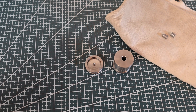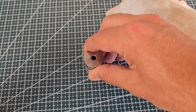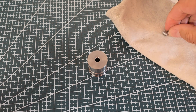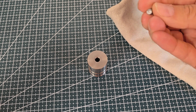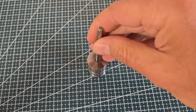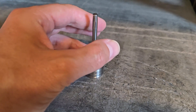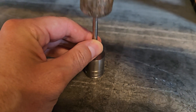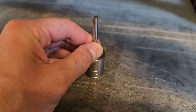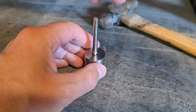Using this die is very simple. If you go for the body and base option, you start by combining these and dropping in a lead piece that is 5.5mm or smaller. The weight of the piece will determine the weight and length of the final slug. You can go as low as 18 grain, and maximum weight will depend on whether you make the base flat or cupped. To compress the lead, I use a hammer and strike the punch a few times till I feel no movement. It's important to perform this on a firm and hard surface like thick metal, concrete, a heavy duty vise, or similar.